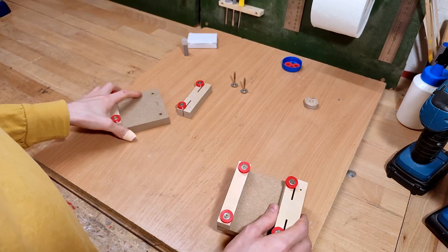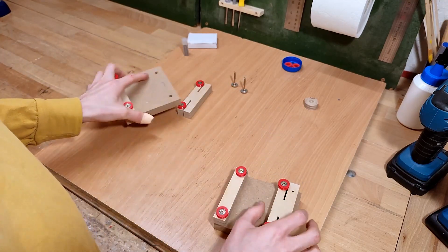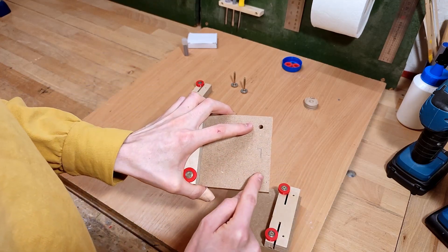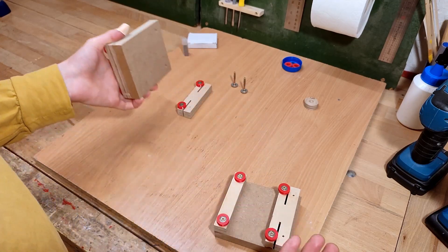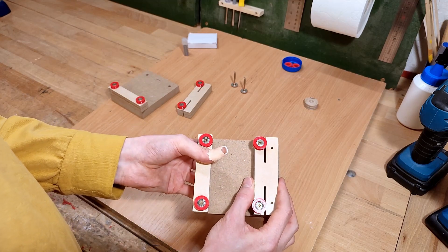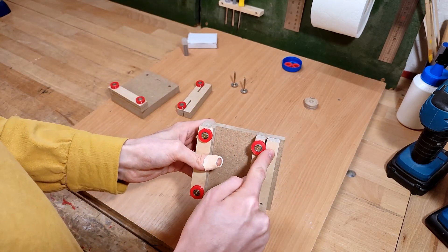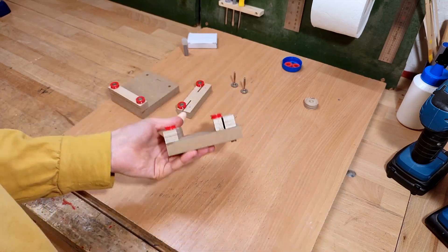Second in my bag of tricks is using oversized holes here to have adjustability for my follower spring. Theoretically you could also make slots, but that's just over-complicating things. We don't actually need that much adjustment, since we transfer the hole locations directly from the actual rail.